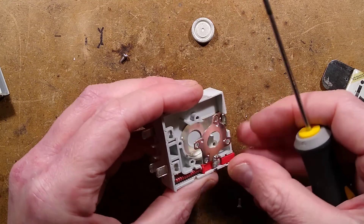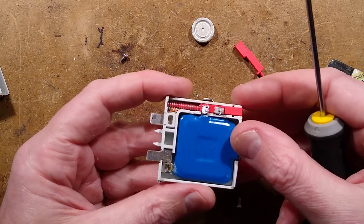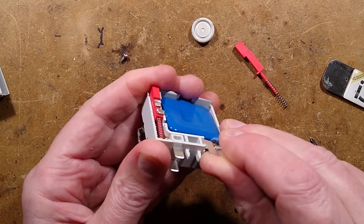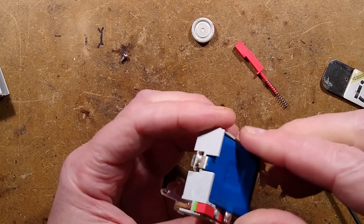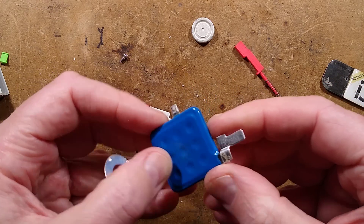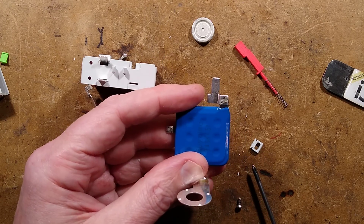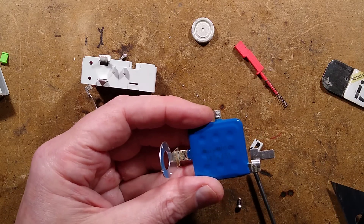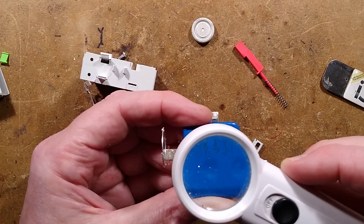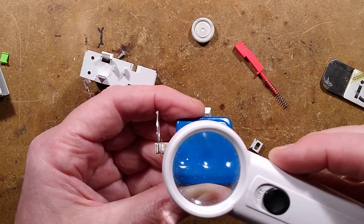Now that red one has pinged up as well. There is the little braided connection going up to it. We can hinge this one up and take a look at this big thing. It's a big flat metal oxide varistor - that's a monster. It looks dipped in a resin. This one says E-U-Y-A-L-E-C, YALEC, 3-4-SK-4-3-1. The 431 is probably the voltage rating - 430 volts.